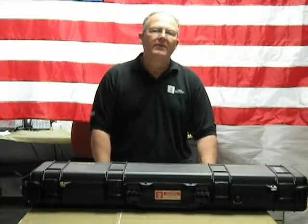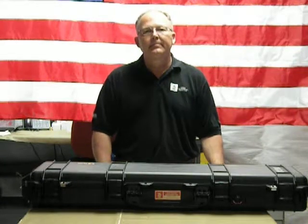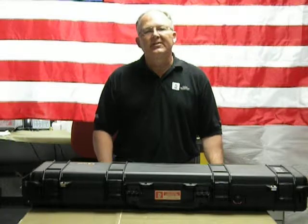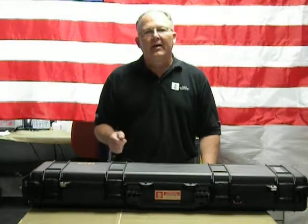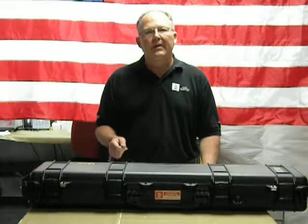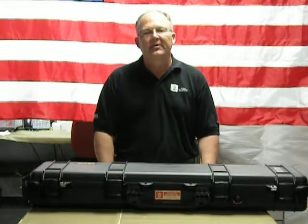To give you some of the background of the DCP, and specifically the Kessler DCP which meets the ASTM requirements, these DCPs were built around the patented research from the Corps of Engineers that developed the hammer size, hammer configuration, and the cone shape and configuration to develop the correlations that provide you with your bearing strengths and your CBRs.